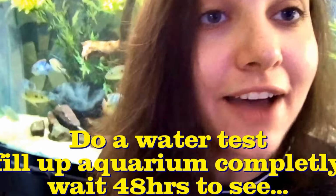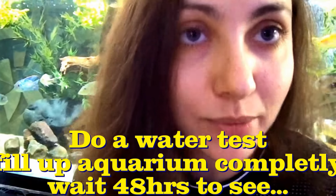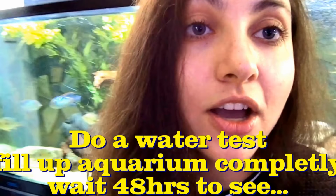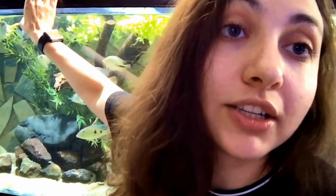We're nearly done in knowing if you're going to explode or not. All right, point number 5, you have to do the water test. After you've covered all the other 4 points and you make sure everything is pinpoint, you have to do number 5. It's your water test. You're going to completely fill up your tank up to the bracing, okay? Because sometimes you'll want your tank to be really full. Up to the bracing, you fill it up and you wait 48 hours. That will tell you if there's any weak points.